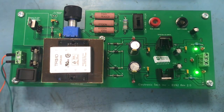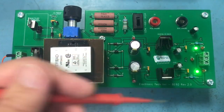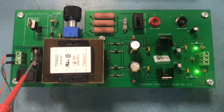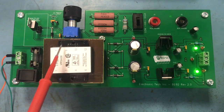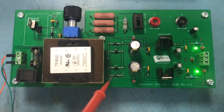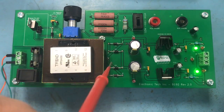So let's put power to this. As we put power to it, with these LED indicators, I can see that my voltages are present. So basically some of the things you can do is step through it when voltage is applied. I'll measure my input, make sure I get my input, and then I'd measure to see if my input actually makes it to my primary side. Then, knowing my transformer, I'll pull up the data sheet and look at my secondary side and see if my voltages are present there. If they are, I'm moving on to my bridge rectifier, and I'll measure across these two to make sure whatever is on my secondary side gets to the input of my bridge rectifier.